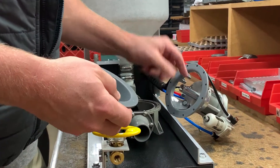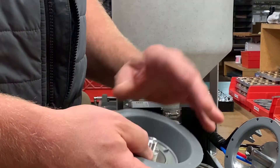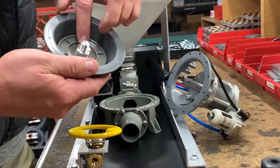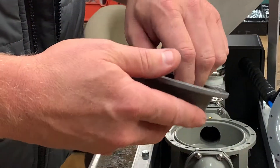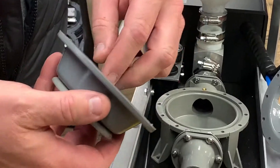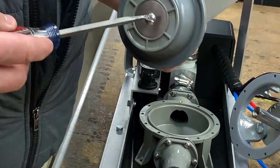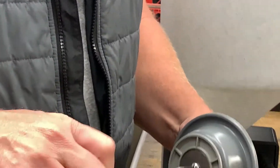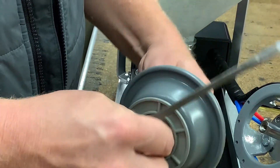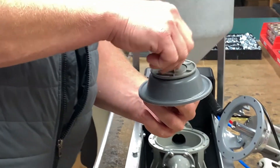This comes out a little differently than your GP1, GP2, GP6, or GP7. You'll notice your air pump has the shaft on the bottom of the air piston — there's no clevis pin like our other pumps. The shaft is built into the piston, and we have an aluminum extension. As you unscrew your truss-head screw, you're unscrewing this whole thing out. Grab the adapter — it has two flats so you can grip it with a wrench if needed — then take apart your clevis assembly.